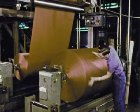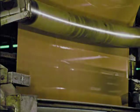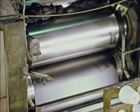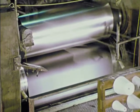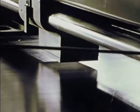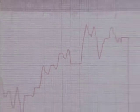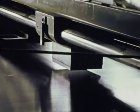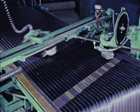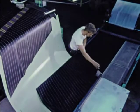Tempered finely in a roller-laden oven, the cord moves to Akron, Waco, Mayfield, Charlotte, and Bryan, ready for use. This is a calender. Here, for the first time, rubber and fabric are combined. Atomic energy plays a role — measuring is done with beta rays from strontium-90, a by-product of uranium processing. General was the first in the industry to use this vastly improved method. After calendering, the tough, atomically gauged fabric, cut on a bias, is spliced a notch closer to the finished tire. Thickness is precise. Angles are perfect. Specifications are demanding.